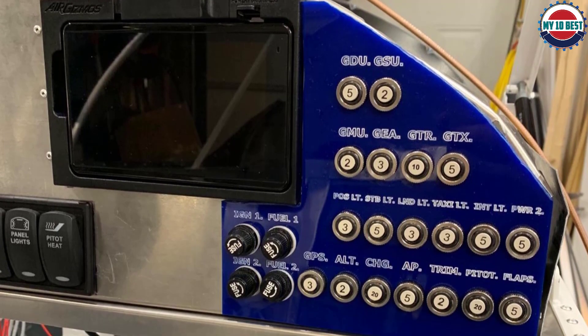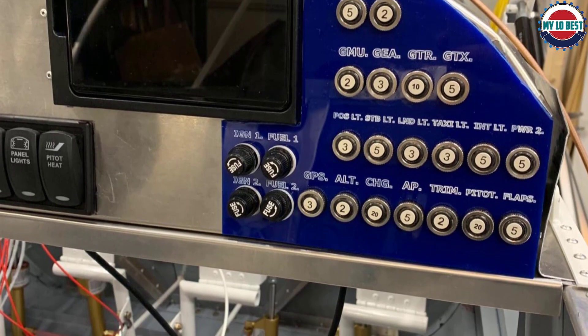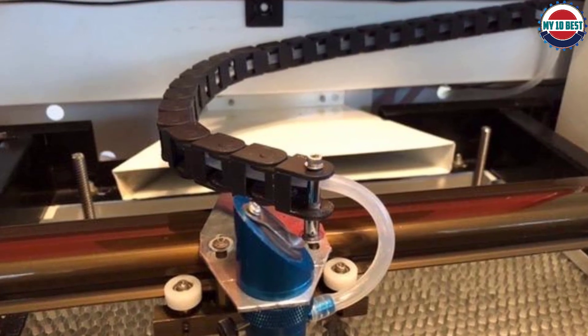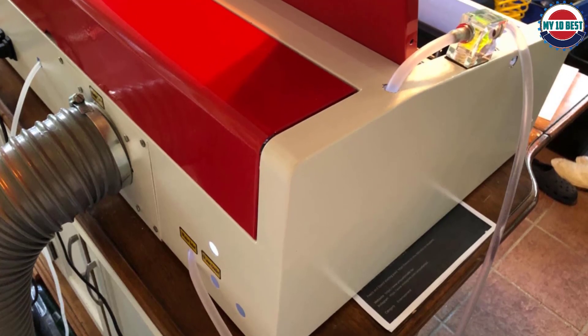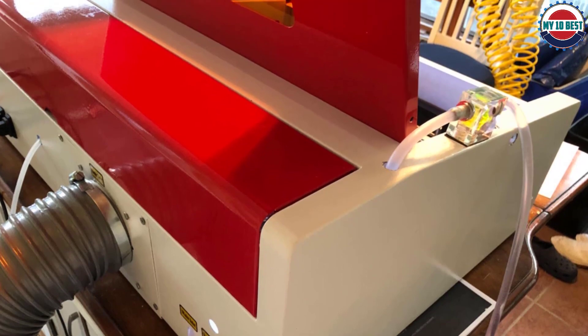It's popular to upgrade and modify these machines to create a more personal, well-rounded product. Certain components that users tend to upgrade include a better exhaust fan, water pump, or even the laser tube. Depending on the material, this laser should cut as deep as 2–3 millimeters, including usual things like leather and wood, but also rubber, as well as being able to engrave coated metal.